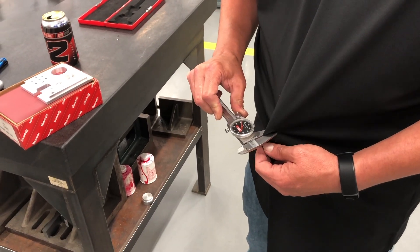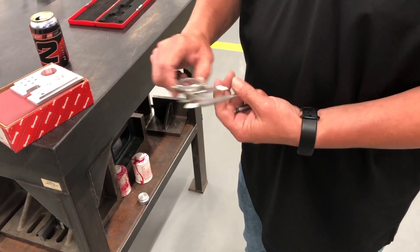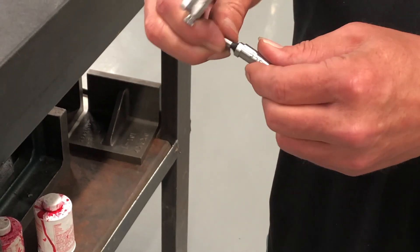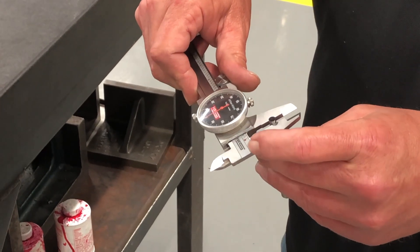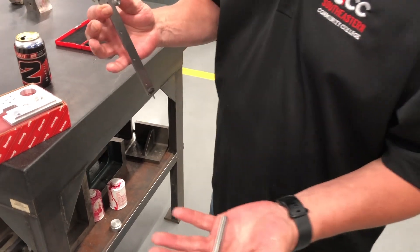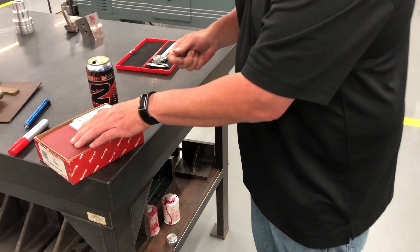Make sure your tools go right through their storage and zero out in the working world. You'll get coolant in there and they won't be zeroed, so make sure they're clean. This is a typical edge finder — it's got a three-eighths diameter shank. Notice how this little tip moves around on a spring. This tip is exactly two hundred thousandths of an inch, and I'd trust that more than dial calipers, which are only accurate to about one to two thousandths. This has been precision ground.